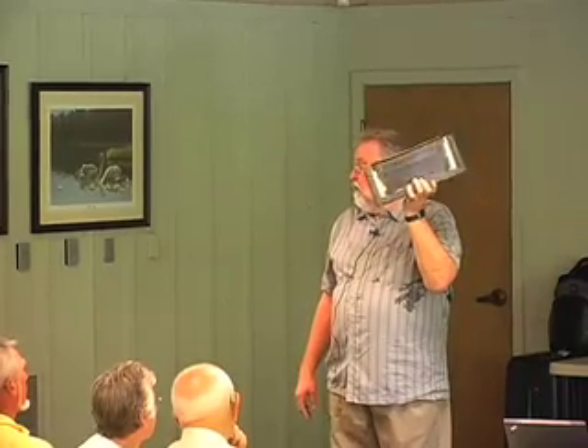Why copper? I've seen many of these 30 years plus old that are still working fine. I would give a flat plate collector like this a 50-year lifespan if it's a well-made collector. When I pass this around to you, you can look at it and see how well the tube is bonded to the plate — that's important. If you just take a tube and lay it on a plate, it's not going to work. It's got to be bonded well — soldered, welded, ultrasonically soldered. Some manufacturers use a thermally conductive adhesive. It has to be bonded though.